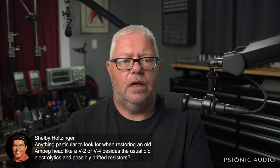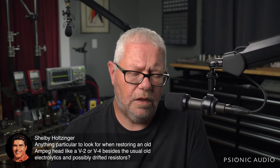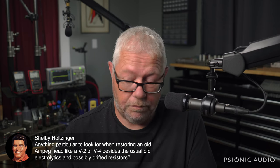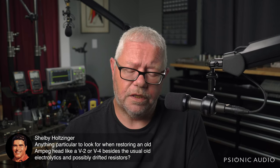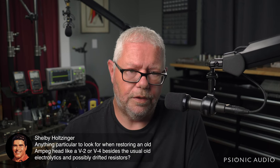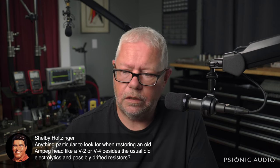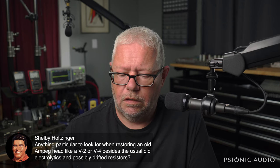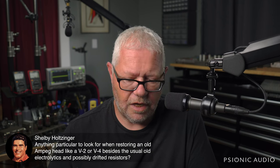Hey, Shelby. Yeah, when you have an old Ampeg, like a V2 or V4, you've got to look out for the dropping resistors and diodes, which often burn the boards. And a lot of those things are running the bias wrong, and a lot of those are putting way too much voltage on the screens for the tubes that are in there. So you can have very short output tube life with an old V2 or V4 at the stock voltages.